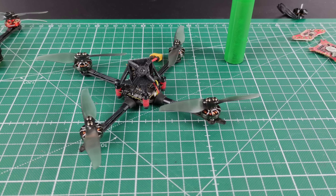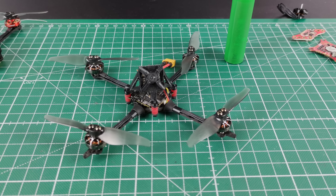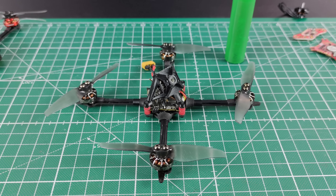So we need to come up with different electronics, or a different way to wire them, so they can deal with such a low voltage. That also means I'd want more space than I have on such a toothpick. Obviously if this thing is made for cruising and longer ranges, one of these SPI receivers isn't going to cut it — it has maybe 50 meters of range and a 25 milliwatt VTX, so you're not going to get very far. The idea was to use a step-up in some way to keep the voltage more stable even when the battery approaches 2.5 volts. I just needed more space in this frame, and a classic toothpick style frame isn't going to cut it — there's just not enough space.